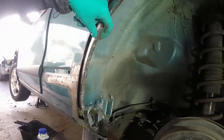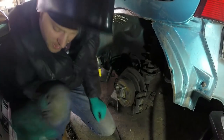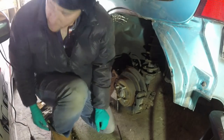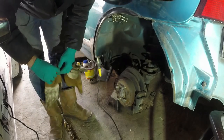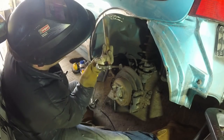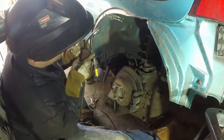This flange is suspiciously short. I think when the people repaired this car previously, perhaps they chopped it out. I don't know — maybe they're all just that depth on Rover 200s. I'd expect a larger flange. I've just made a couple of little repair patches. One's clamped in here, the other one is going to go in there. I'm just going to try and weld them in without blowing big holes, which won't be fun because it's upside down welding and it's thin metal and it's on the edge of a flange. I've left my patches a bit longer so that I can sand back after, but it just means it's easier to weld and less likely to burn back.